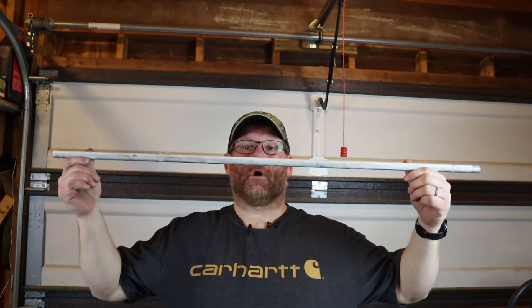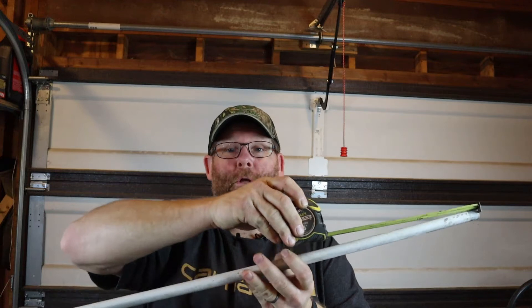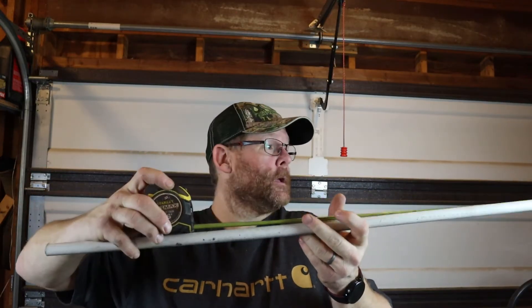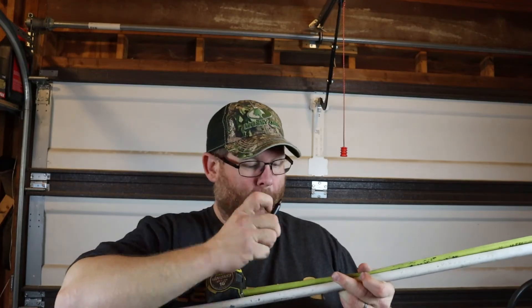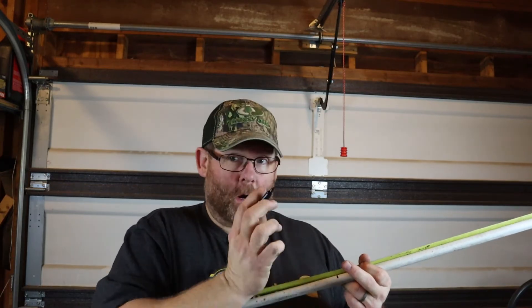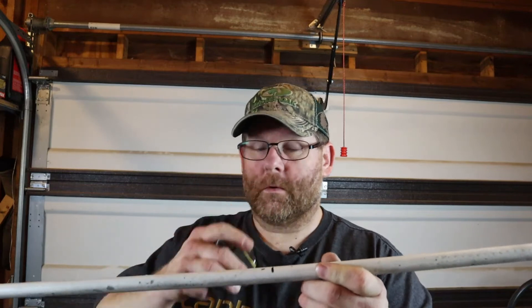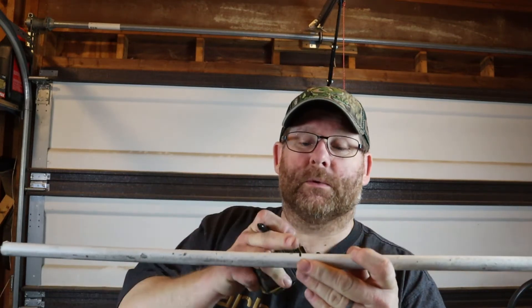Let's go ahead and jump right into this star. I'd ordinarily have a longer piece of pipe but I want to keep this as much in frame as I can. When I use the star, I like to make sure I keep my tape measure the same distance. We're going to bend this at two foot, so this part right here will be two foot. I'll take my sharpie and mark two foot, and then I'll make just a little mark — that means I need to face that bender handle this way.